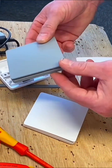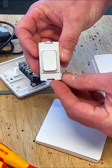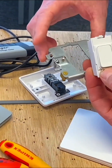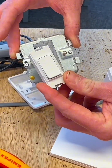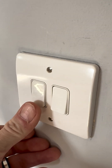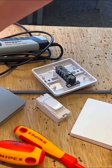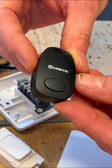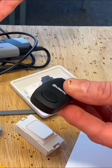They do some different designs of these switches. I've got another very similar one here but in gray. I've also got this one, which is quite handy — it's a grid switch. We've often seen on site things like this yoke or grid mounting frame, and we can position the grid switch into those. That could be paired to the receiver, which is quite handy if you had a two-gang version and had a standard light switch alongside a Quinetic switch for something else in the room. And possibly my favourite — that is also a switch you can pair, which looks remarkably like most people's key fobs for opening the car.